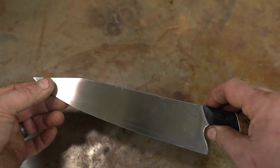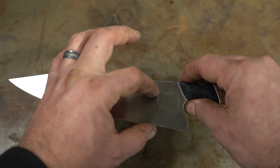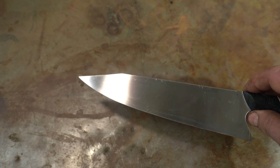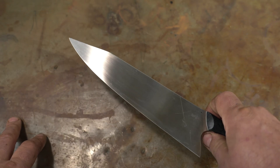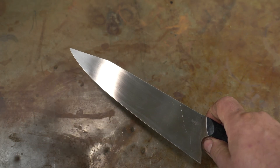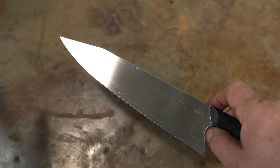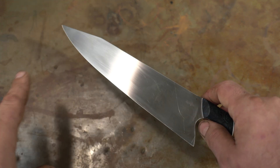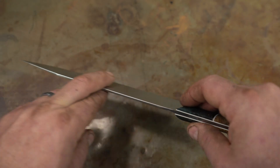But for longer blades like some swords where you have a very narrow bevel and a really long blade — for katanas, for example — they will taper from about 300 thousandths of an inch all the way down to maybe an eighth of an inch at the tip. So they do taper and you need to usually put that in purposefully.